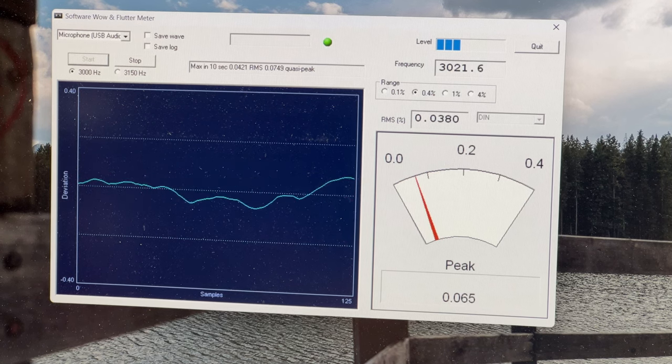I am concerned about this trace that's lifting. Oh, here we go. Now we can access the solder pad for that capacitor. And when I go back in with new capacitors, I will use my Kapton tape and PTFE tubing, and that'll take care of that.